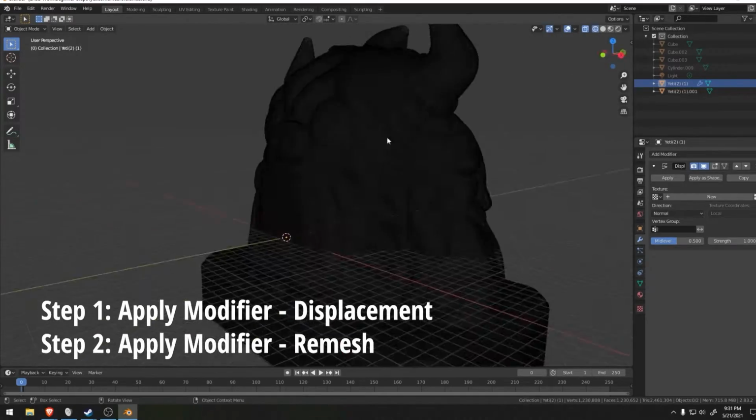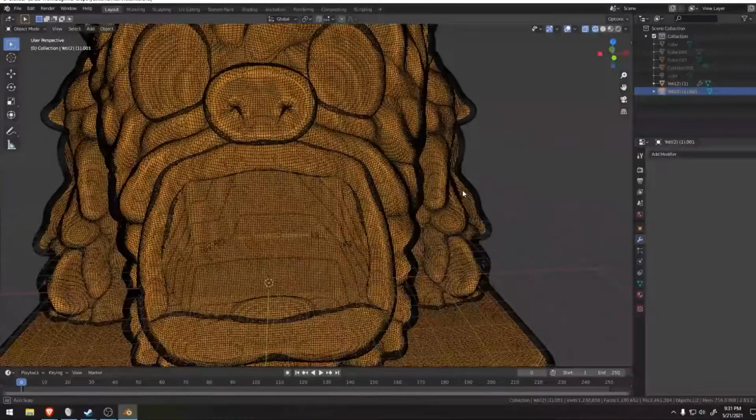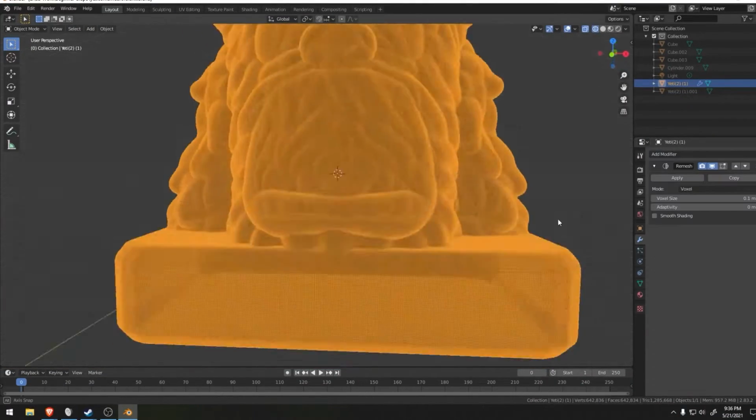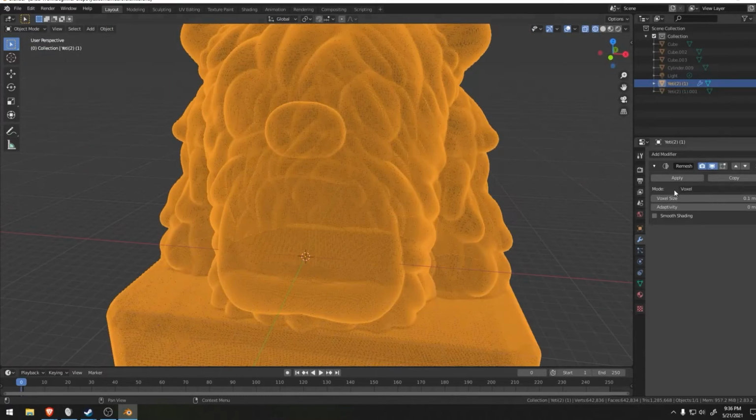You may notice there's a big box covering the toy's feet. That's because any areas that have too many nooks and crannies won't perform well in a vacuum former, so it's best to box those areas out.